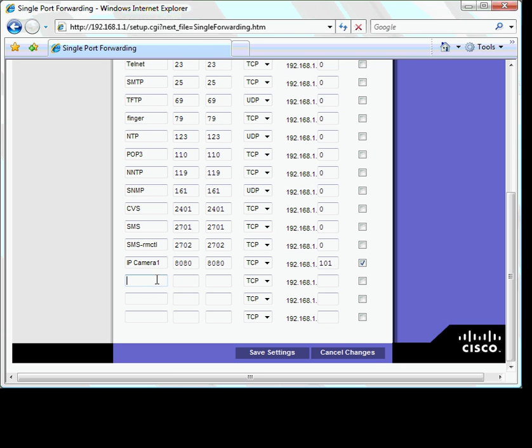Please make sure you click Enable. Now let's set up the DVR. Remember, we have to assign a unique port number, and we'll use a sequential port number. Leave the protocol as TCP, and we'll assign a progressive IP address — in this case 192.168.1.102. Then click Enable.